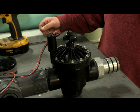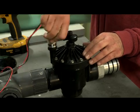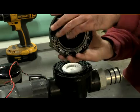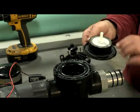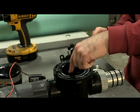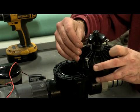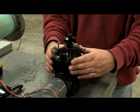Occasionally debris will get caught in the diaphragm inside the valve. To do maintenance on the valve, first unscrew the solenoid from the valve. Next, unscrew the bolts on the valve face. Open the valve carefully and remove any debris around the outer ring. Then remove the diaphragm and clean away any debris around the edge. Be sure also to clean any debris around the diaphragm seat inside the valve. Finally, using a common paper clip, clean out the hole in the solenoid opening. Once clean, reassemble the unit, making sure to line up the diaphragm tab with the seat.